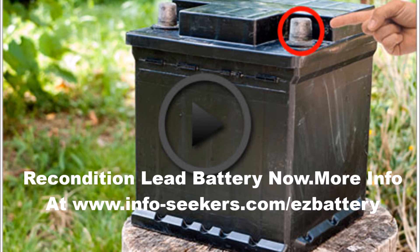How often should you apply an equalizing charge? Different battery manufacturers recommend different intervals. The most common interval is monthly, but other manufacturers recommend once every 6 months, while others recommend every 10 or 12 cycles. Check with your battery manufacturer to see what they recommend and follow that interval. Additionally, make sure you are adding water to the battery every month and every time you perform an equalizing charge.